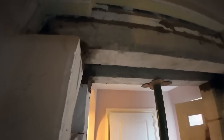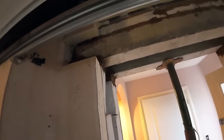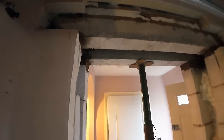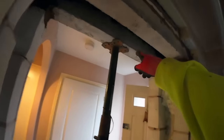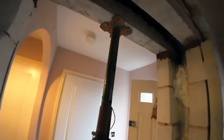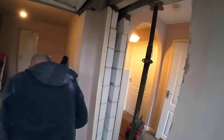There it is. Well, it looks weird there because this insulation's so thick, it looks like we've gone back. Looks like a missing lintel. But they're both in. We're going to leave this acro in tonight just because that one's got the padstone sitting on it. So we'll leave it. It's packed solid with slate, both ends and under the padstone. Yeah, so it's well packed.